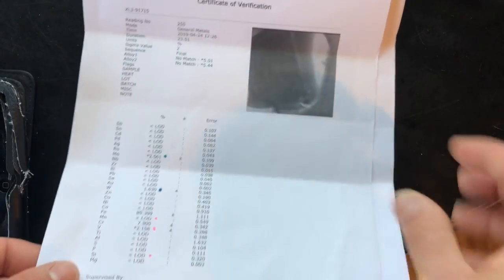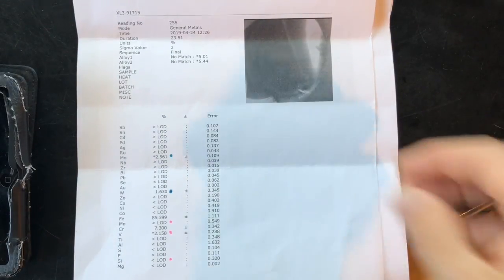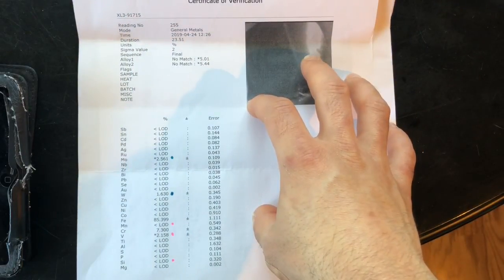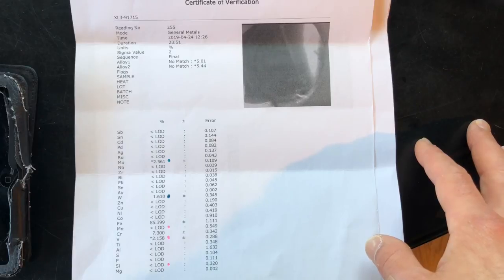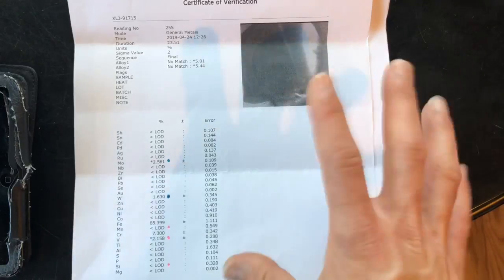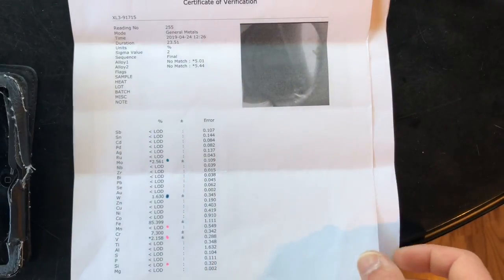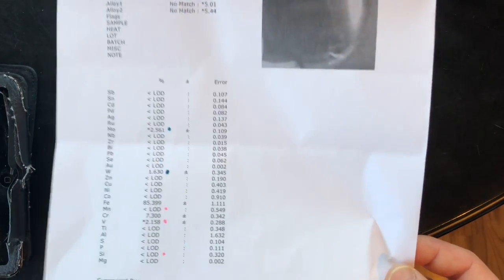I did notice the Cruwear performed really well for me in the PM2 — in toughness tests it did perform really well, even without the manganese and silicon. I wonder what it would be like if they were in there — would it be an even tighter grain structure and take an even better apex? As far as the HRC on the Cruwear PM2 — this came up at 62 HRC, which is right in range and an excellent number. Cruwear can be optimized within about 60 to 65 HRC — up into that 65 is where it really comes to life for edge retention. But at 62 HRC we're getting a really great all-around steel: super tough, great edge stability, takes a super fine apex. No huge complaints — performed great.